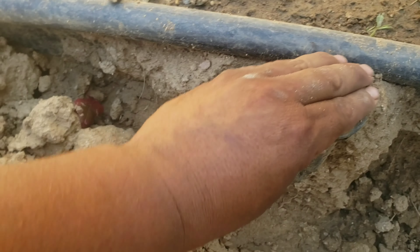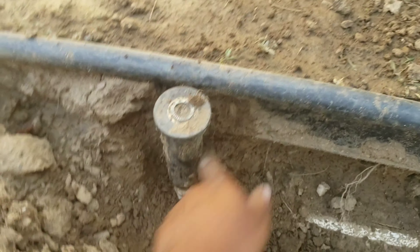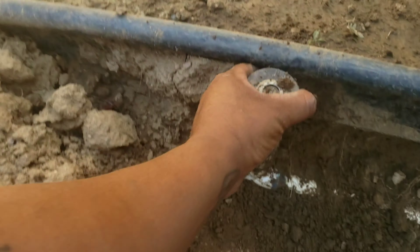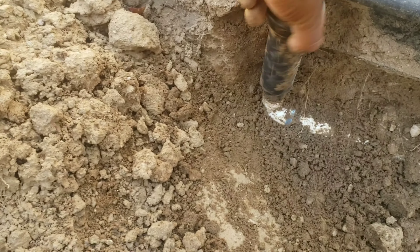We're going to open the tee here — it's the irrigation system. Most of them have a coupling or a threaded coupling, a riser. You go ahead and unscrew the sprinkler. Most of these sprinklers leak from the riser — it's always broken by the gardener. Then you unscrew it and screw back the coupling or the threaded riser.